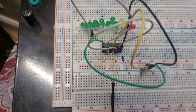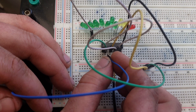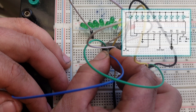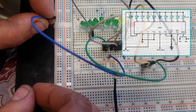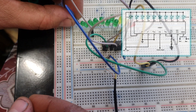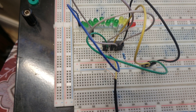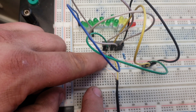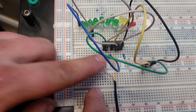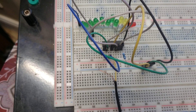So now for our power we have to not only run the LEDs, we also have to run the chip. Number three is where our power input goes, and I'm going to take and run it over to this line, which is actually going to be power — not ground. Now all we will have to do is run some power to either side, get a ground, and then hook up some music and check out the lights. Man, groovy.